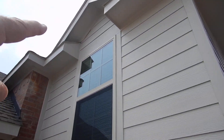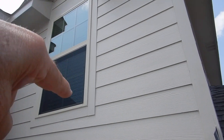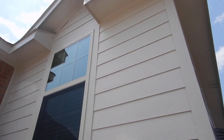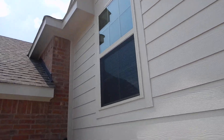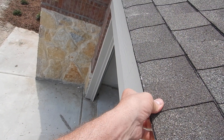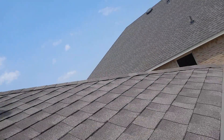On our window casement as it goes around up here — on the casement board, that's the horizontal case, this vertical case, the upper horizontal case — and the window, we should have z-bar flashing so any water that gets behind the wall can come out. The shingles overhang like they're supposed to. Some of the drip edges are lapped a little tight, and we want to take some things into consideration when it's time.